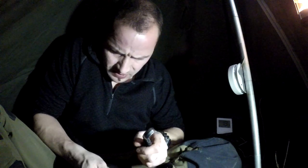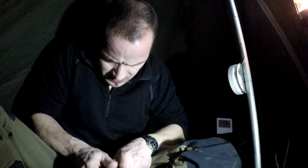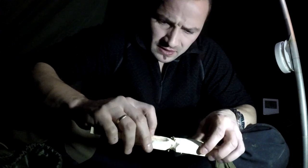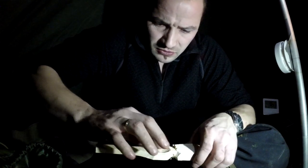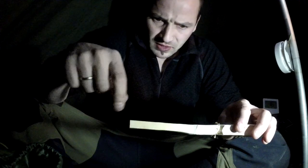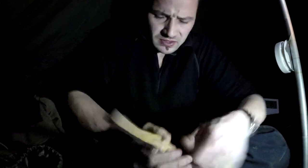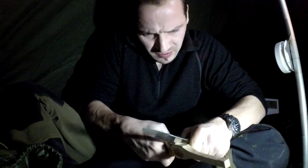A teaspoon is like, you put your thumb in and you get a good thumb feeling. Should be good. I do the bowl very early in the carving, and I finish it up later, fine tuning it and making it straight. So now I have the handle, I might shape the handle a little bit both ways, this way and this way. It depends a little bit on the wood. And I keep this upper part for a very long time because it's very nice to hold on to when I do this type of carving, which is very difficult if I remove it.